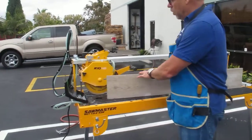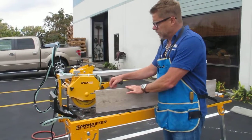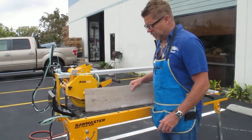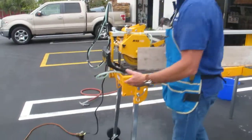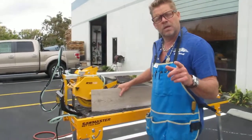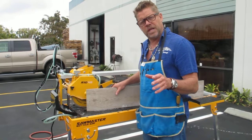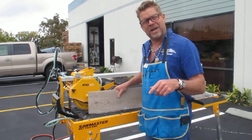This is a 1.5 horsepower motor. It uses about 14 amps, so you guys got to pay attention. A lot of you veterans probably already realize you have to have an extension cord that will carry enough juice. You have to make sure where you're plugged in is a big enough breaker. Most standard breakers are 15 amp, and the new breakers now pop real easy — and they're disposable, so you have to go buy a new breaker.